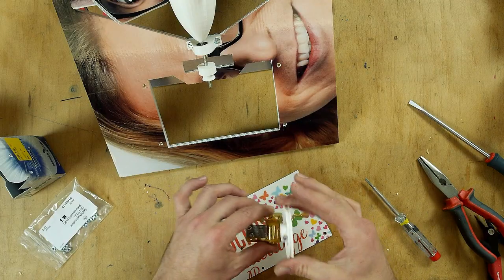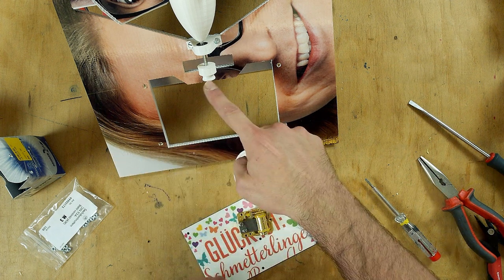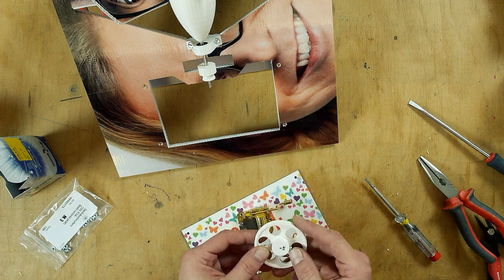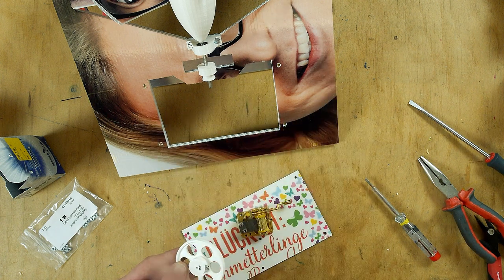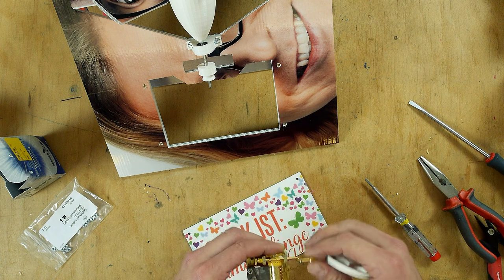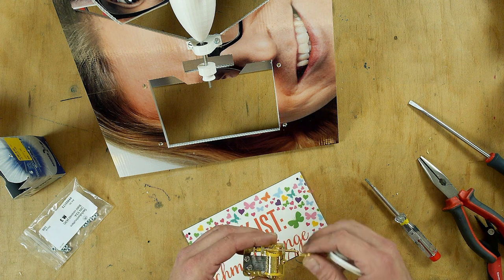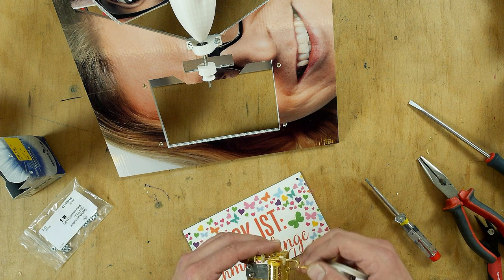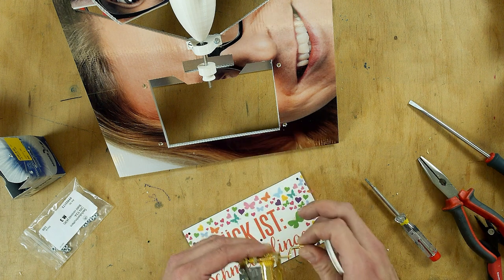So this goes on here, and as you can see, this pulley here is much larger than the small pulley here, which means that the wind has to spin the windmill, the rotor, a few times until this here is cranked once. It also means that since this still takes a little bit of force, it's not without any force, it goes easier for the windmill to spin this.